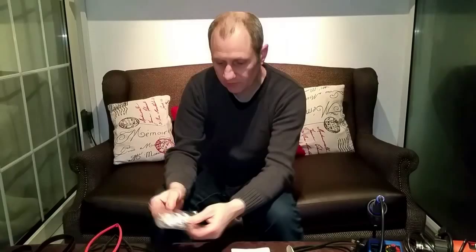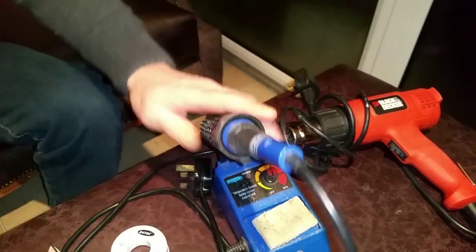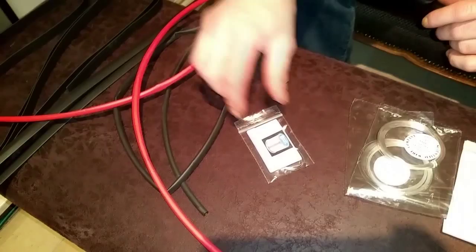Hello, welcome to another Tweaker Man video, just like my first one, but this time we're going to be making high-end speaker cable. I'd like to show you some of the stuff you're going to need to complete the task. First of all, we're going to need our conductor material, which is 0.6mm 10% silver-filled copper. We're also going to need PTFE tape for insulation, a soldering iron, a heat gun for the heat shrink, heat shrink in different colors, and silver solder. You'll also need some speaker connections — some banana plugs.